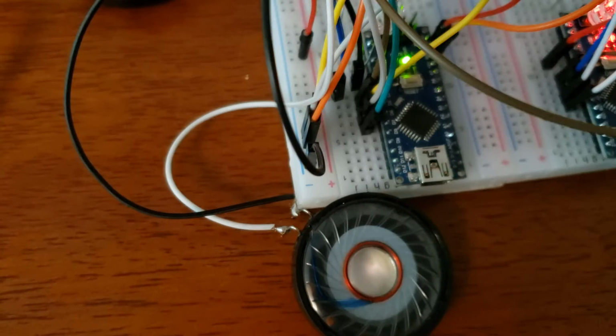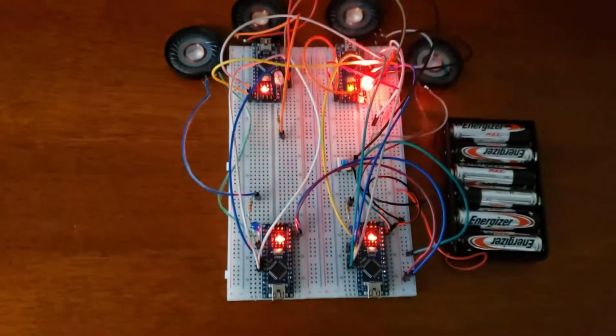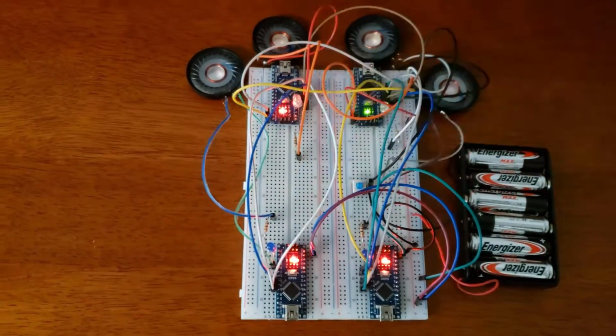So it turns out one Arduino can only play one tone at a time, even when given multiple speakers. Solution: just get more Arduinos. And that's where more problems emerged. First, the Arduinos need a way to play in sync.